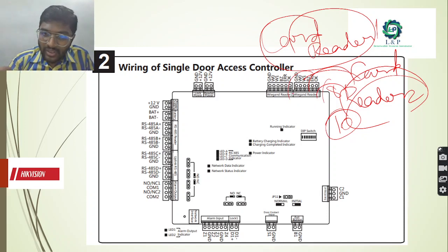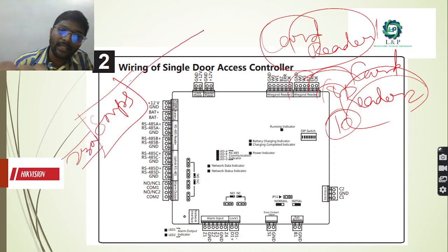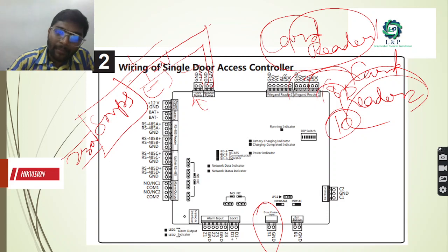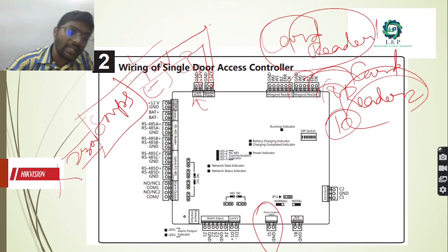As we told earlier, for these card readers to work properly, we need a power supply of 12V. We have an SMPS at 230V, converting and connecting the positive supply to 12V and the negative supply to ground. For the card reader to work, we need to provide the supply. In the same way, for the output - if you want your door contact and lock to work properly, you need a lock power supply, so you need to tap and connect positive and negative supplies for the door locks to work properly.